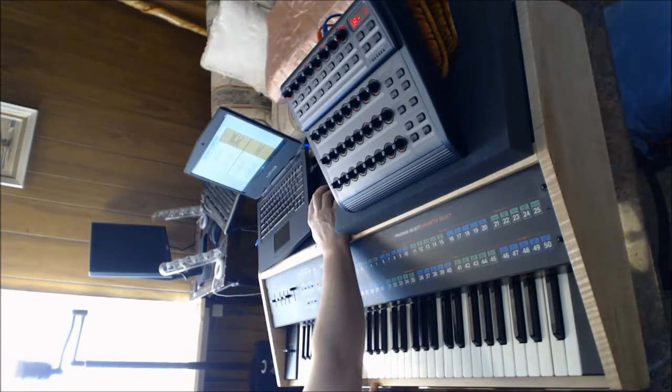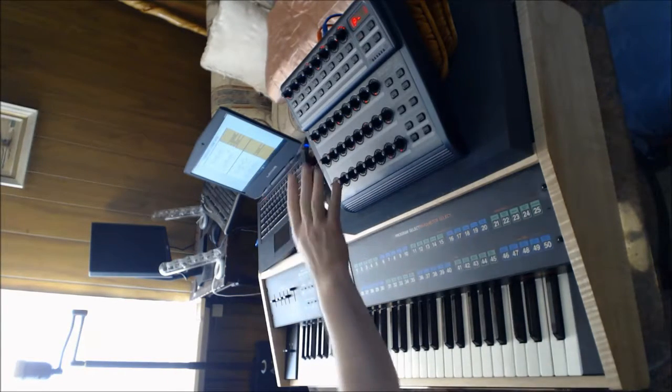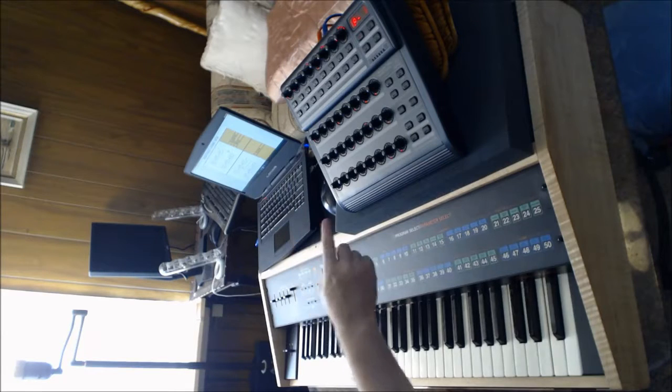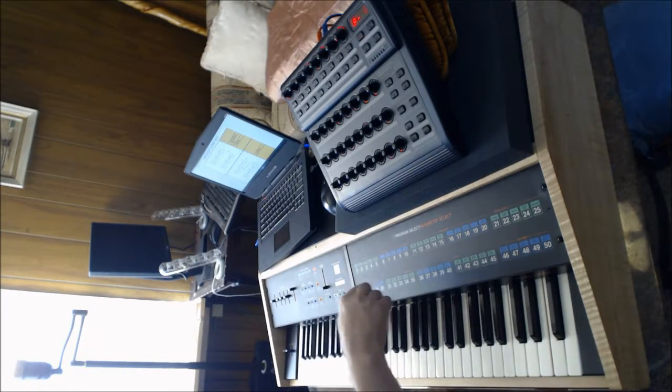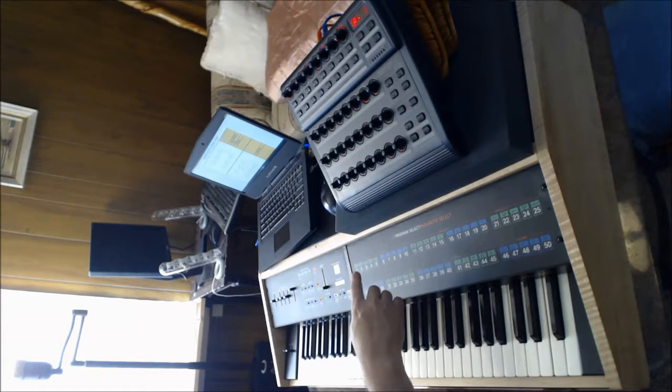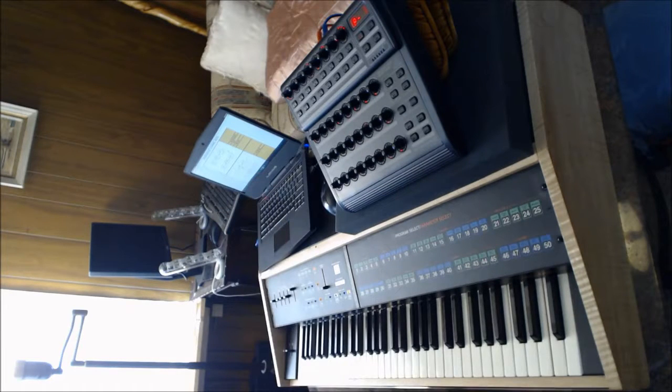That would be, let's see, it's not the 16-channel mode. It's the independent channel mode, where oscillator A runs through filter A, and it goes out amp A. And oscillator B goes through filter B and goes out amp B, and then they mix together and go out the output. So you can detune A from B, and I've done that here. I think it's a fifth? Can we hear that? I don't remember. It was last night.